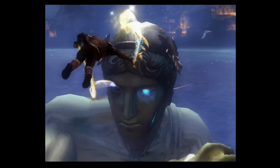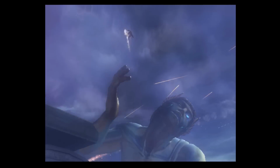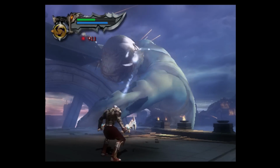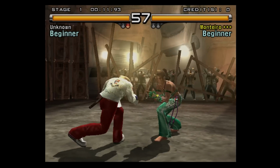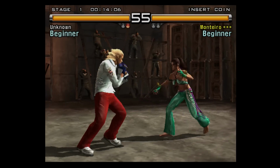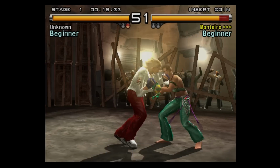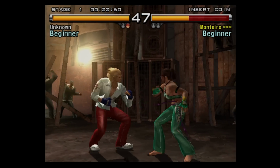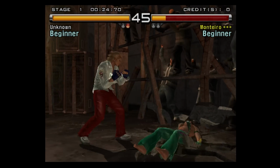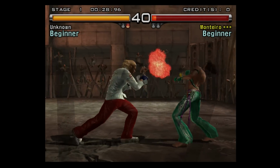Because the issue with the PS2, which I can show you a ton of gameplay of as we go through, is that each game can put out its own weird setup for video, whether it can do widescreen but not progressive scan, or it can do the 16:9 setup but with a weird, less than 480i resolution that is then moved to that, and then the adapter attempts to figure it out from there through de-interlacing, and it can be a nightmare based on which game you're playing.